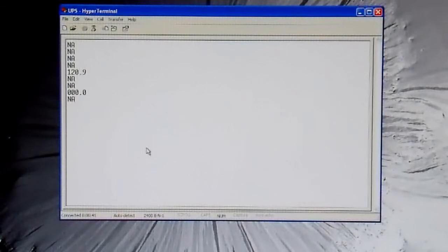We need to enter factory calibration mode. To do that, press number 1, wait 3 seconds, and press 1 again. It responds with PROG — that's for Program Mode. To use Program Mode we're going to use the capital P command. Using the plus and minus keys, it spits out numbers. F1 is the current setting — that's the sensitivity of the current gain sensor. I want to increase the capacity by 50%, so this unit goes from 980 to 1,500 watts. Every unit will be different because this is factory calibrated, so F1 is specific to this unit. F1 is in hexadecimal, base 16.